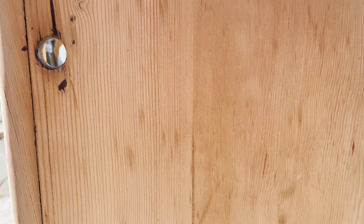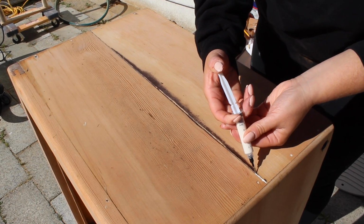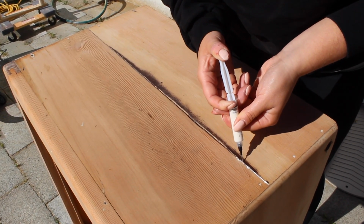This ice chest is made out of cedar, and cedar is a very soft wood, and there is lots of cracking and splits. Somewhere there were planks glued together, some just random cracks throughout big pieces of wood. So I filled up a glue syringe with some Gorilla Glue and put glue in all of those cracks and clamped everything together and let it dry.